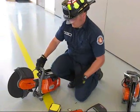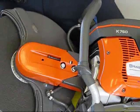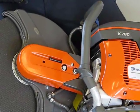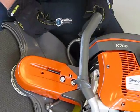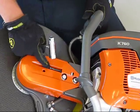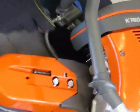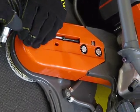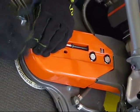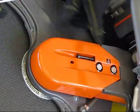Now on to the way to adjust the belt. To start with, explaining how to adjust the tensioner of this. First, you want to make sure that your tensioning screw is up all the way against the guide, and to loosen, adjust and change the belt, first you want to loosen your adjustment screw to relieve tension from these bolts themselves. Release it enough and you'll be able to notice the difference.